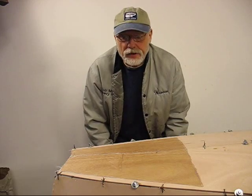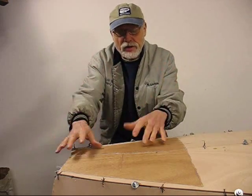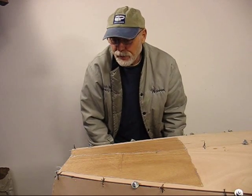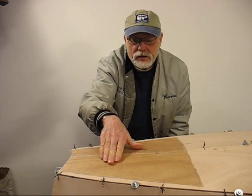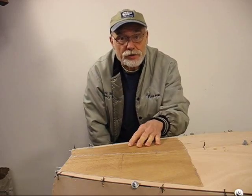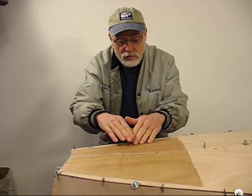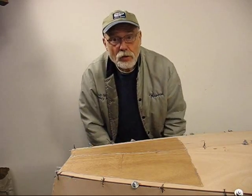I have a little problem here. As I had the boat on the other side and was trying to pull the stern panels into the V-line on the stern — crack. This thin, limber four-mil plywood just snapped. So I had to put a patch on the inside, and I just flipped it over and put a patch on the outside back here, about the last foot and a half on the hull. I did the same on the other one just in case it breaks again when I flip it back over. The fiberglass layer is going to definitely make it stronger to resist the bending moments.